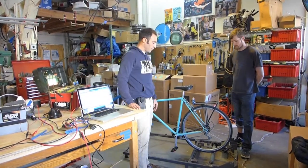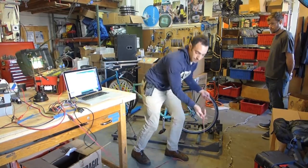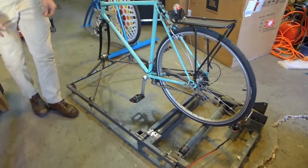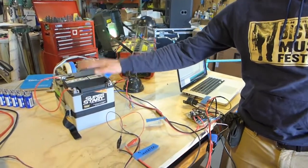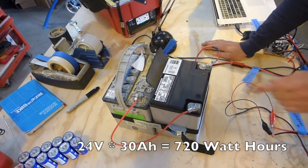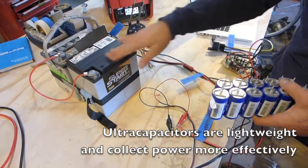This is Peter's generator. What he did was take apart an old treadmill frame. We measured the system voltage and determined it was going to work well with a 24-volt system, and wired it up through a connector. When you spin a motor backwards you can produce power, so he stuck a bicycle on and welded a fork mount to the treadmill frame so he can get on and pedal. The next important components are the voltage sink — this is a 24-volt battery, actually two 12-volt batteries in series, about 30 amp hours each, making it about a 600 watt-hour load. You can also use an ultra capacitor like this; we use ultra capacitors inside our own utility boxes — they have some advantages over batteries but are a little bit pricier.